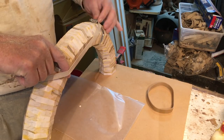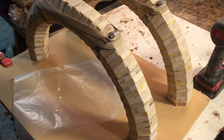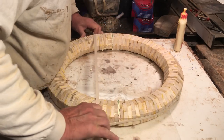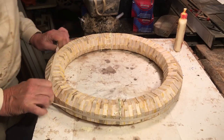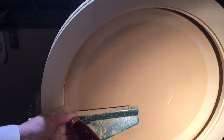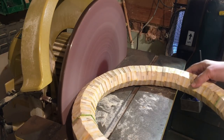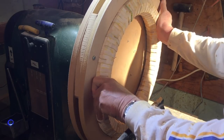Now I'm down to the half pieces. The hose clamps only act as an anchor for rubber bands going perpendicular across the seams. Now let's put these halves together — I've got a spacer of green veneer, one-sixteenth inch thick, in there. That'll be where I cut these back apart. To turn the donuts I need a jam chuck — something that will fit the outside of those donuts quite snugly. I'm turning some MDF and doing a little disc sander work to improve the roundness of my donut, trying to get a good fit in the jam chuck.